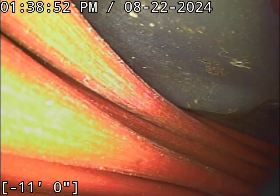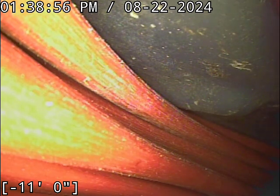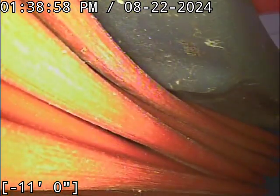So because that's interior stuff, I don't really mess around with interior. It's stuff I can locate, but I really can't mark it at all. So that's what I would have a plumber come out, locate and assess, and bid for repair on that. You've got 2 to 3 inches of standing water there, and there is debris buildup that indicates the line has struggled to drain there in the past.